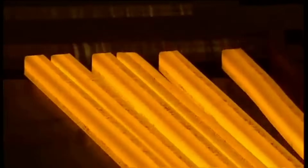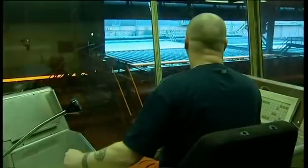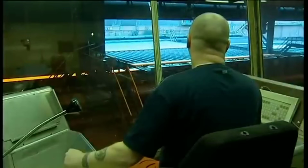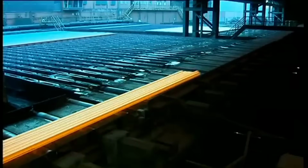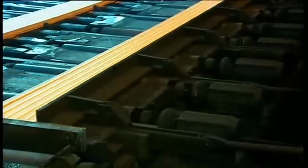For slabs and billets exceeding specific dimensions, an alternate route was taken to bypass the finishing mill. This route involved dropping the V-rolls and moving through the bloom flying shears, P9, towards a different transfer point known as T3.